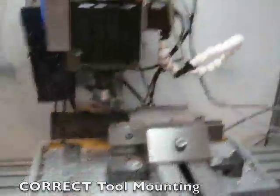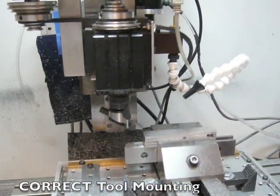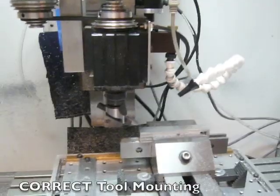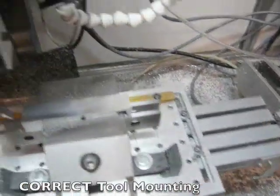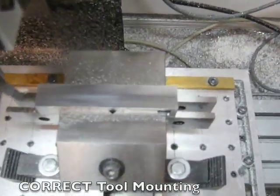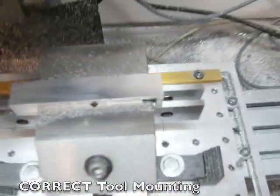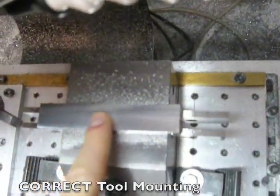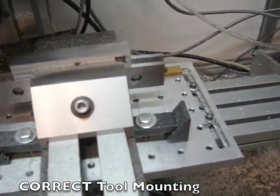I also shortened up the tool length a little bit to try and give it a little more rigidity, and just wanted to give you a quick look at what I just cut. I was able to cut 1 thousandth of an inch — that's the cut — going at 4 inches per minute with 2,800 RPM on the spindle. And the finish, frankly, is every bit as nice, if not even nicer than the stuff I was cutting last night, which you're about to see here in a second in the video.